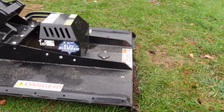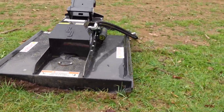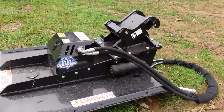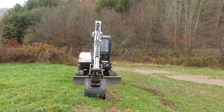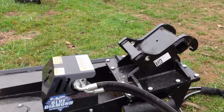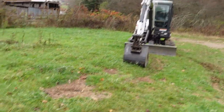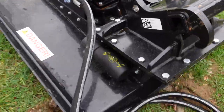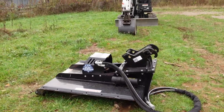I have to wait for a proper building to go up, and you know how things are these days with construction. Hopefully that will happen sometime in the next six months. This brush cutter, and in general the mowers that attach to mini-excavators, are powered using the excavator's auxiliary hydraulic system. These hydraulic lines take hydraulic fluid from the excavator, and the pressure of that fluid is what turns the blade underneath.